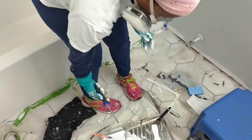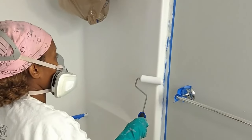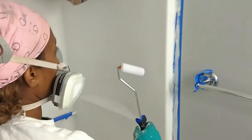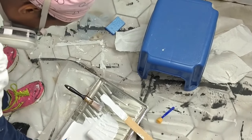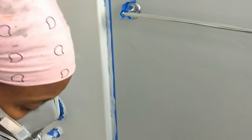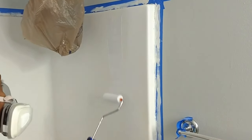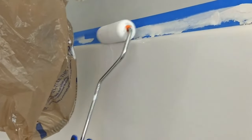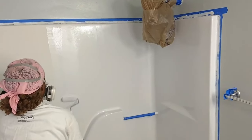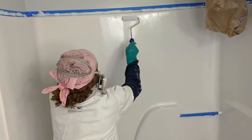The first thing we noticed was the lighter consistency of this top coat paint. First, we created a lot of streaks, so we had to remember to keep the roller wet with paint. Tiny bubbles were created when we applied it with the foam roller. But the bubbles disappeared as it dried, and we could see how the paint and primer were reacting together.